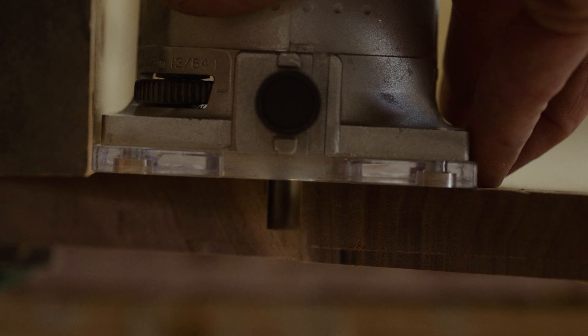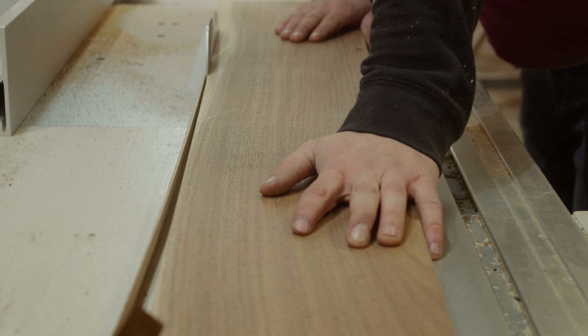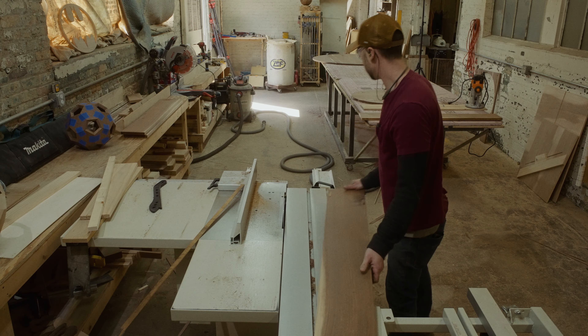While that little piece was drying, I began prepping the other pieces of walnut that were going to make both tables appear thicker than they actually are. I made clean edges on the table saw, then set an angle to cut each piece to. Essentially, they were just acting as a frame around the circle, making it appear thicker on the sides. I wanted to add bevels because I wanted the table to appear more thick — so instead of using eight-quarter-inch stock and making this table cost way more money, I opted to use a couple thinner layers stacked on the outer ring.